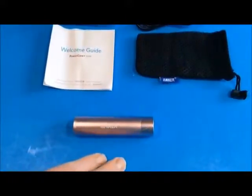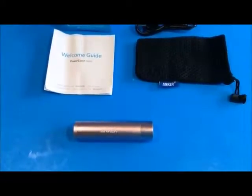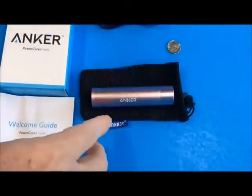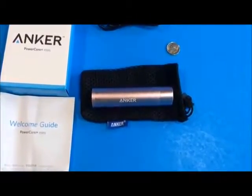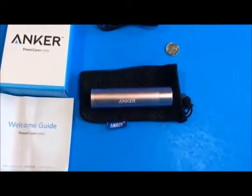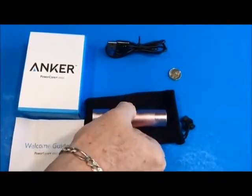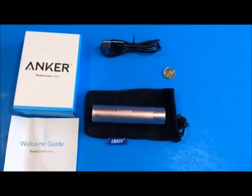This is a good product. Even though its capacity was a little bit limited, its ideal use is portability for a quick charge on a smartphone. For that reason alone, it's worth 4 stars. I can't rate it any higher because this battery is touted to be 90% efficient, and it's not even close — it only came out at 58% efficient. At 90%, it should have been able to produce 3,015 mAh, and I was only able to get 1,965 mAh. It's still a good product and I love the size, but I can't give it 5 stars for that reason.